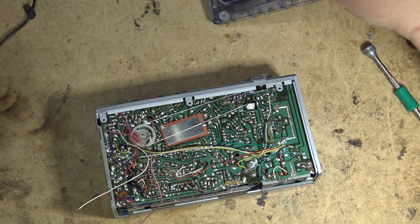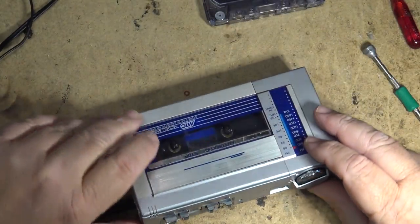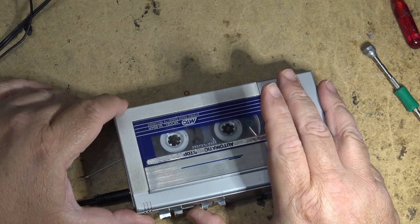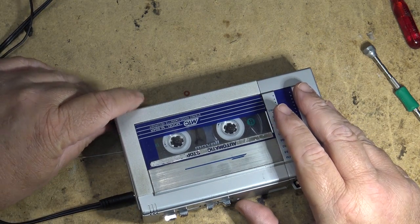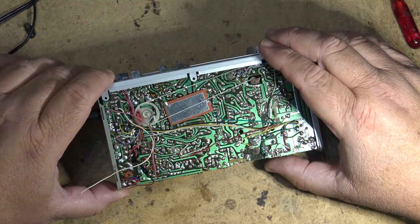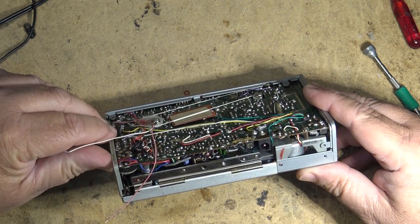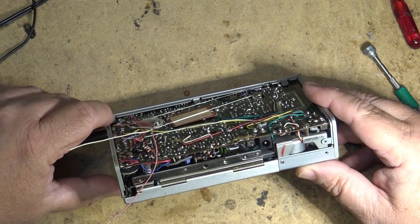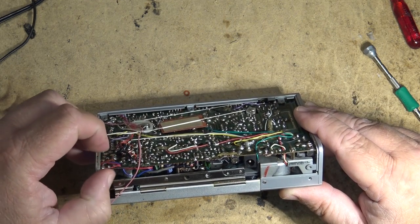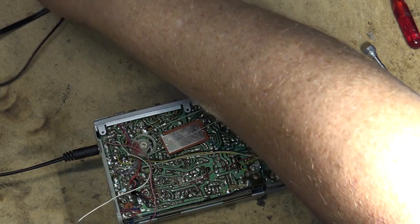So I'm just letting that thing work in. I'll put my test tone on here. We'll see if the speed has come up on this at all. It's been working in there for a few minutes. So this is my 440 tone. Still sounds like crap, but at least it's going about the right speed now. A little bit, 441, 429. That wow and flutter is going to, of course, make that jump all over the place, but at least that part's working better.